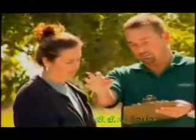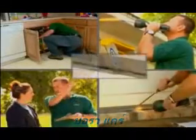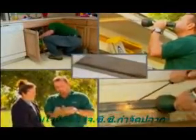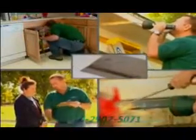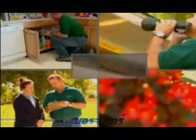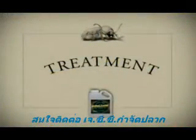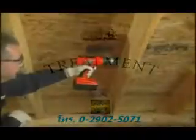After the technician conducts an inspection and determines there is evidence of an infestation of drywood termites, the next step is to determine if any wood has become structurally unsound and therefore must be replaced. Replace all structurally unsound wood before doing the Boracare treatment. Now, let me give you a brief overview of the treatment process.